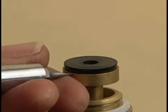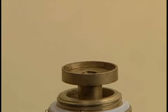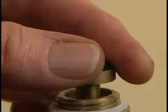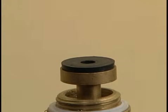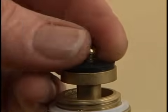After removing the screw, carefully pry out the old washer with a small-bladed screwdriver and replace it with a new washer of exactly the same size and shape. Secure the new washer with a retaining screw.